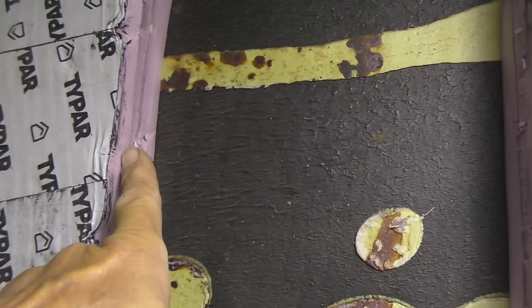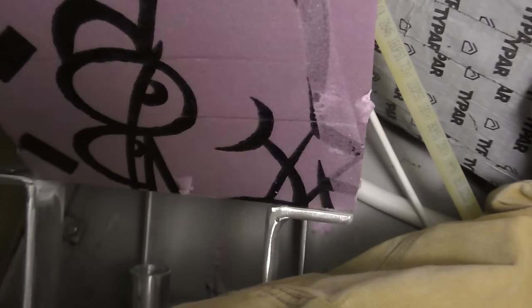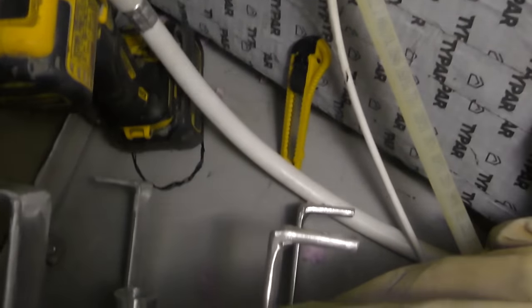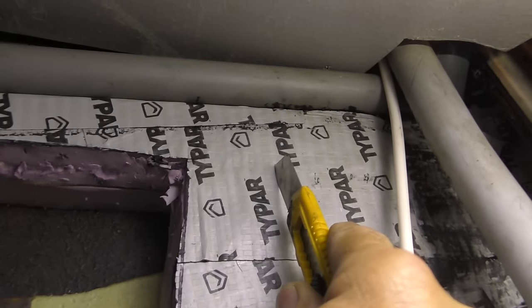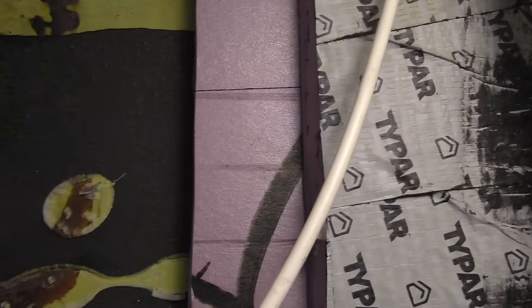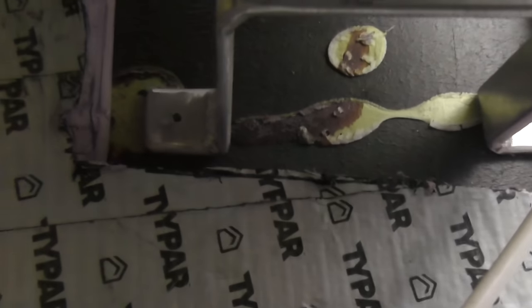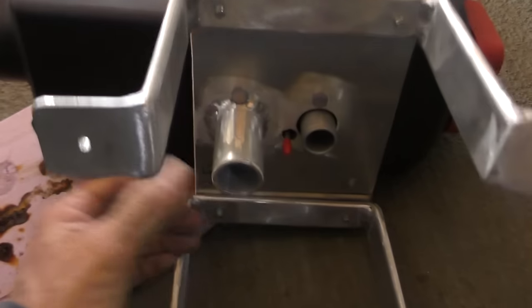Welcome to underneath the kitchen countertop. I've got two one-inch pieces of foam in here — that's two inches thick — and some construction tape over the top. This yellow stuff is coal tar on the steel hull outside. I only need to make it about two inches wider so it'll fit my bracket. I measure from this bulkhead to here and take my two inches out over here. The heater goes up there and we'll drill through the brackets a little bit to mark the holes. On second thought, it'll be easier to take the heater off the bracket and then mount the bracket without the heater — but now we know it all fits.